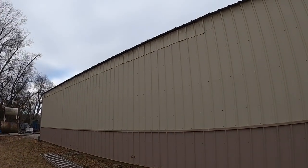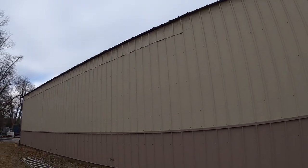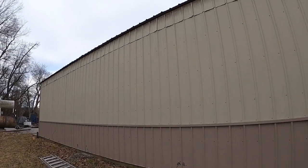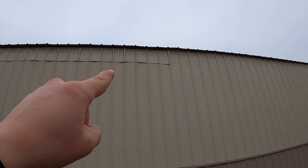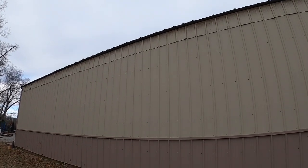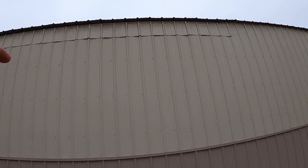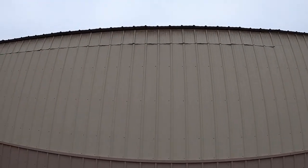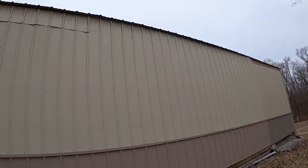The last thing you saw, I think, was a time lapse of us doing the next 20 feet on this thing. So we got all the metal cut down to the fourth post, got the headers up, and then I went ahead and took the pieces that we cut, dropped them down a little bit so they overlap, and screwed that stuff back up there since we're having some weather, you know. And seems really dry inside there. That's at least keeping it from going down the ribs of the metal, getting the 2x8 or 2x12 really wet, which that's really not going to hurt it to be wet, you know, for a few days before we get it covered up. But that's where we are.